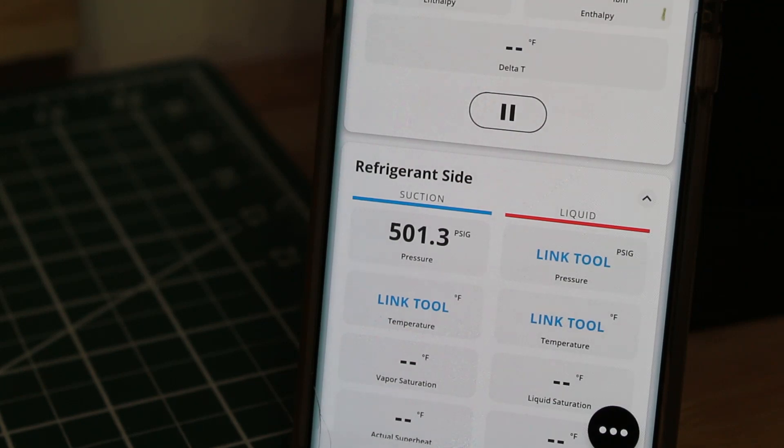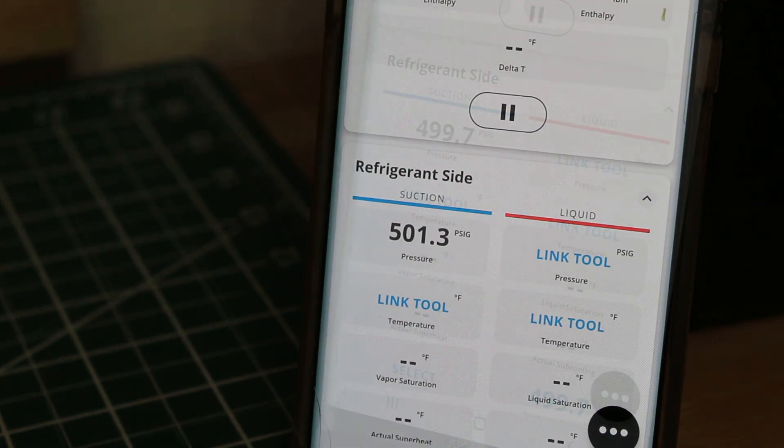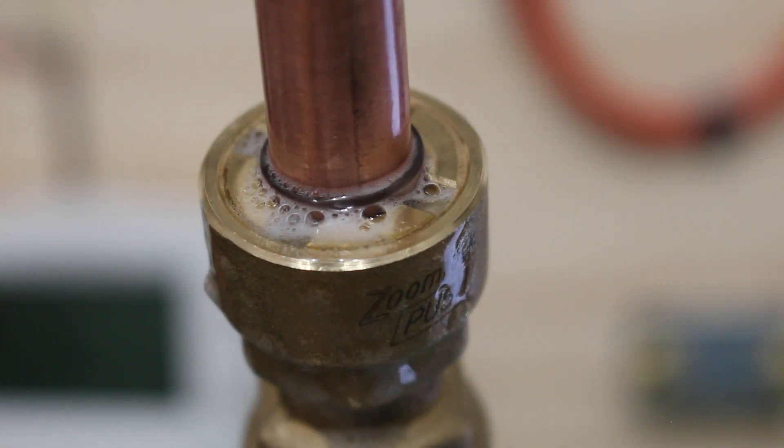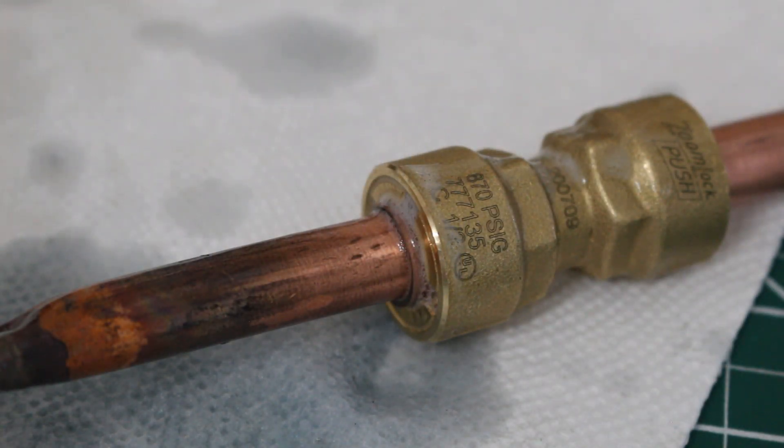I got more nitrogen — we're at 501.3. It's been a bit over 10 minutes and we have lost pressure. We're down to 499.6. Let's take a look at the fitting. It's clearly not leaking as it was before, so preparation definitely is key, but we are losing pressure — just a small amount, almost too small to see. Looking at the other side, to the naked eye you almost can't tell it's leaking. You really have to give it time. I see tiny, tiny little bubbles on the other side as well. We didn't notice it because the opposite end was just leaking heavy the first time.